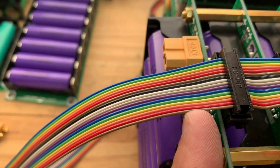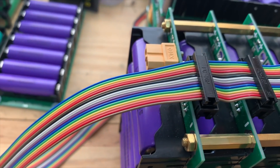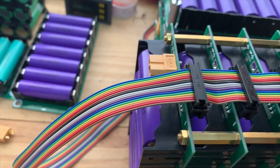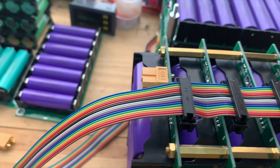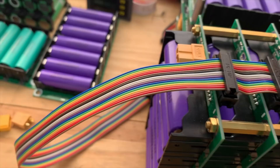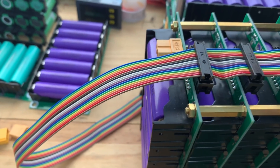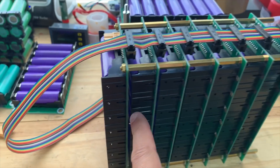So you'll have two cables — the brown and the red will be the same pin — meaning if you miss one of them when connecting, you have redundancy: two cables carrying the same lead. And not only redundancy to account for bad or weak connections, but it will also allow us to run double the power output through these little cables, because these are small — something like 26 or 23 gauge.